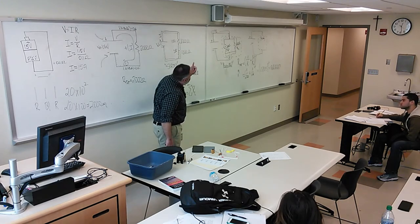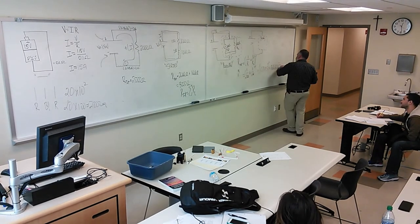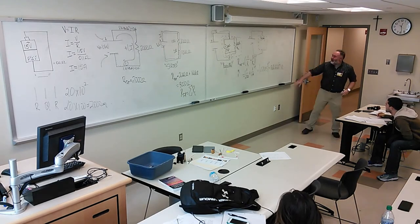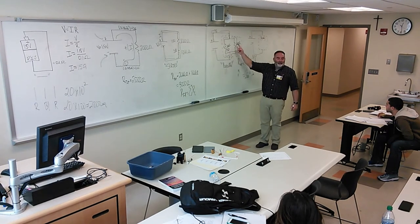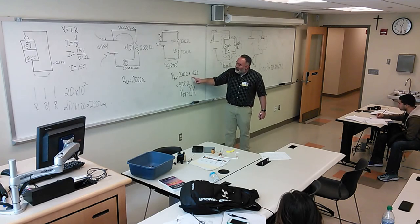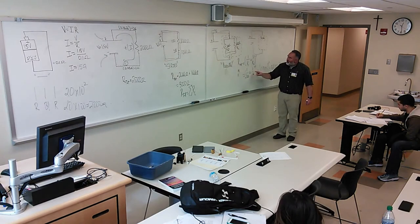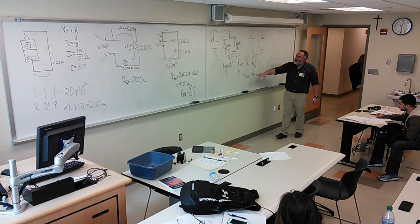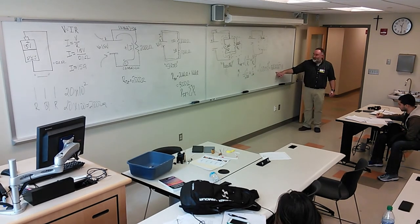Resistance is 666.6667, repeating, ohms, okay? Is it zero? No. However, it's smaller than any one of these guys, okay? This guy was 2 plus 1 equals 3. This guy was 1 over 2 plus 1 over 1. Well, you have to go ahead and do the calculations and get a common denominator. It's actually 2/3. Then bring it back,